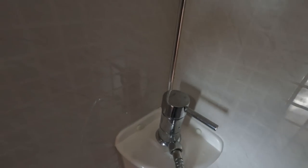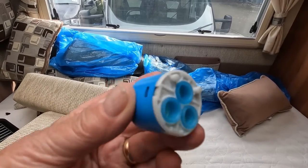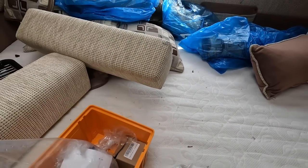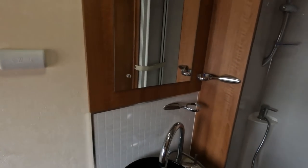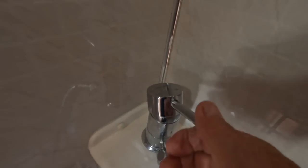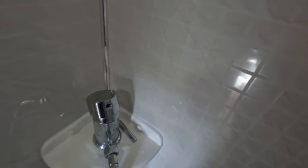Your first thoughts are, oh I've got to replace the tap — no you don't. So I'll show you what the cause is. The tap actually has a cartridge in it — there are three different types of cartridge. You can get these cartridges from B&Q or anywhere like that. What you need to do first is extract the old cartridge. First thing we need to do is turn the tap on to release the pressure into the wash basin, and then unscrew the stem of the tap.